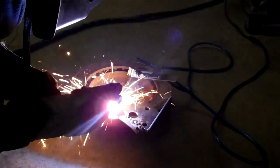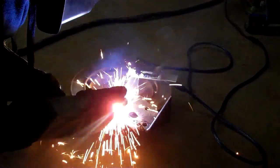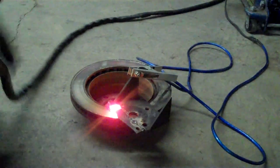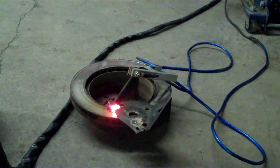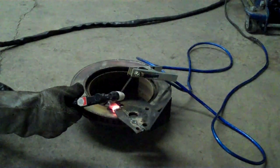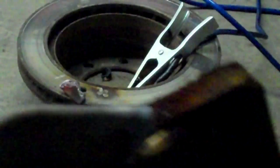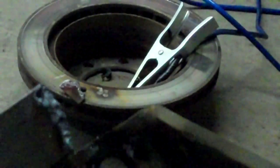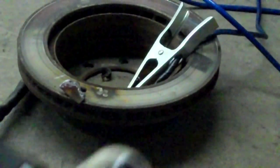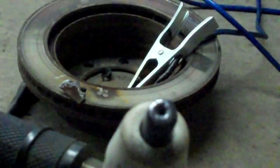If I hold off away from it a little bit, it seems like it spreads out more. Look at that tip, how hot that is. Maybe I'm holding too close, but when you start off, you have to touch it, so I don't know. We'll try switching out the tips and see what difference that makes. You can see that it's just kind of blobbing. So it is cutting it, but at the cost of having the consumables obliterated. It gets really blunt and really large diameter quickly.